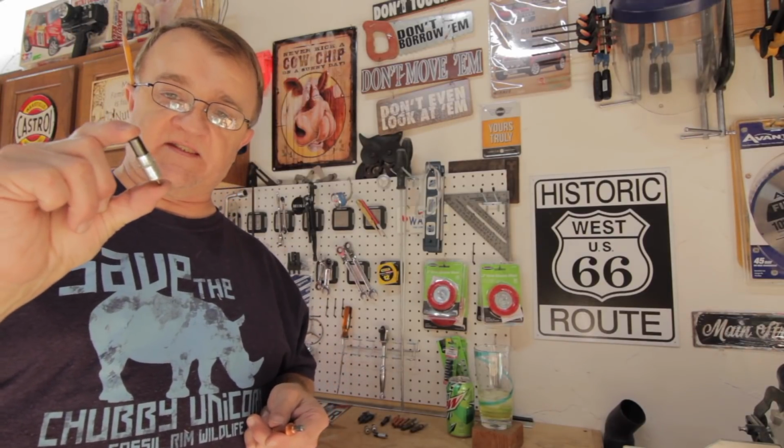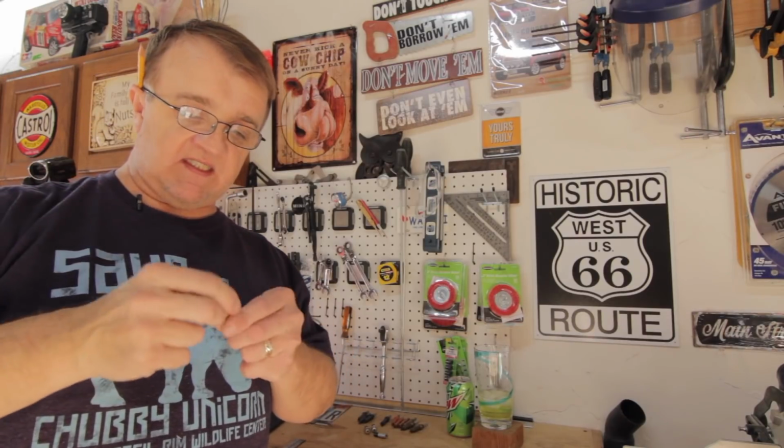All right. So the first thing I had to ask myself with Clecos is, which Cleco am I going to use? I have 4 of them, and there are basically 4 different types. You've got silver, which is 3/32, about 0.09 inches. Then you've got a copper one, which is 1/8, 0.125 inches. Then you've got a black one, which I believe is 5/32, 0.156, somewhere in there. And then you've got a brass or gold color, and it's thicker. I don't remember what it is, but it's thicker.